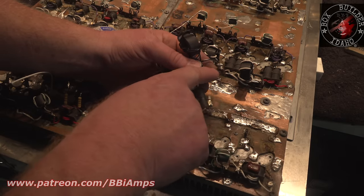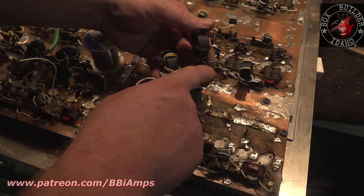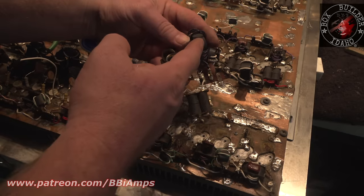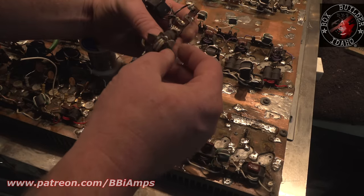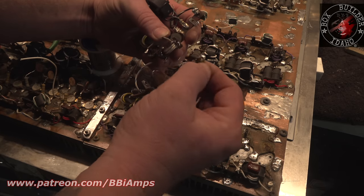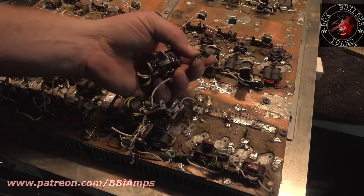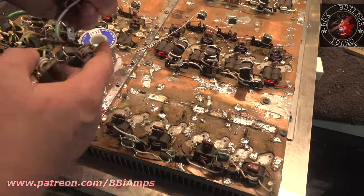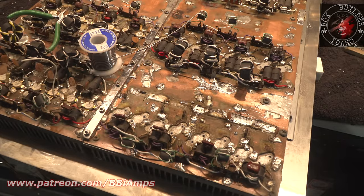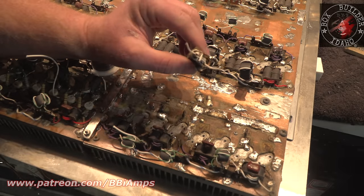That's probably why this solder tab here has been on fire a couple times. And that's probably why this transformer has been rebuilt so many times. That's what's left of this trace on this transformer. This little glob of shit. See that? Let me turn the gain back up. A little glob of shit. The front and the back side of these transformers are completely borked off. Look at this. That's the back side of the transformer.